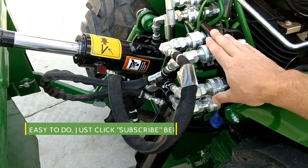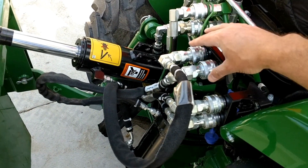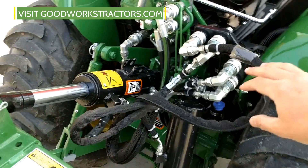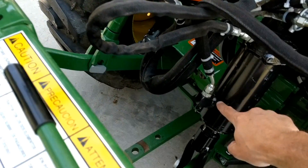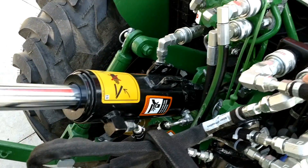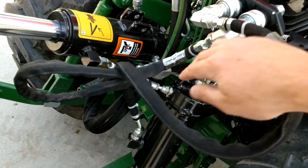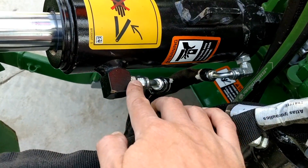Running top and tilt requires two additional hydraulic valves, so you have two connections here for each valve. It's going to allow the flow to go either direction. On John Deere, these are called the fourth and fifth valves. You'll see the hoses come off here — one will work its way down and tie into this side of the cylinder, and then this other hose will come around and connect right back up here. The other two connections are these two hoses following down, with one coming to this side and one to the other side over there.